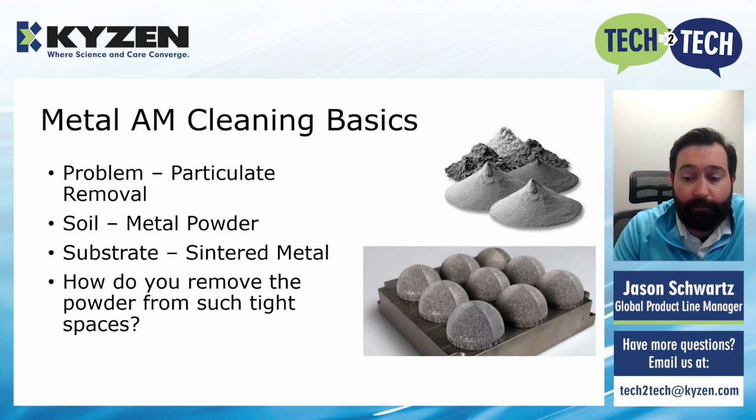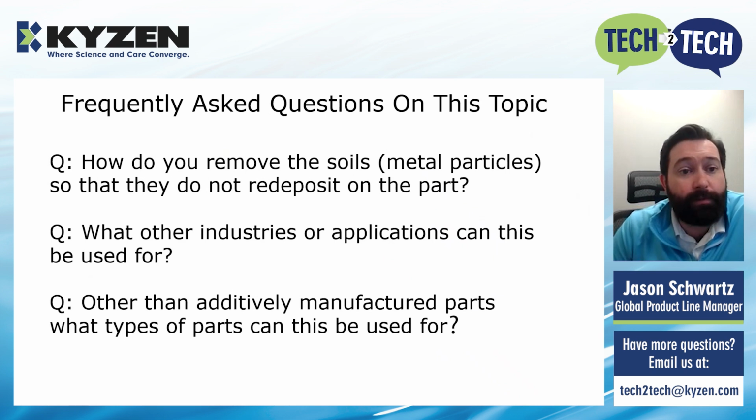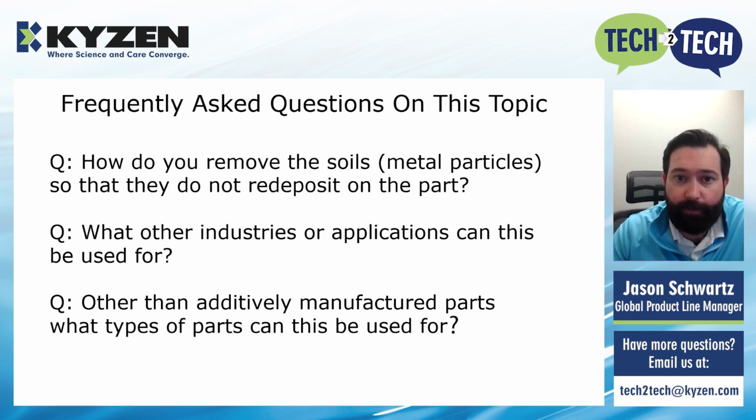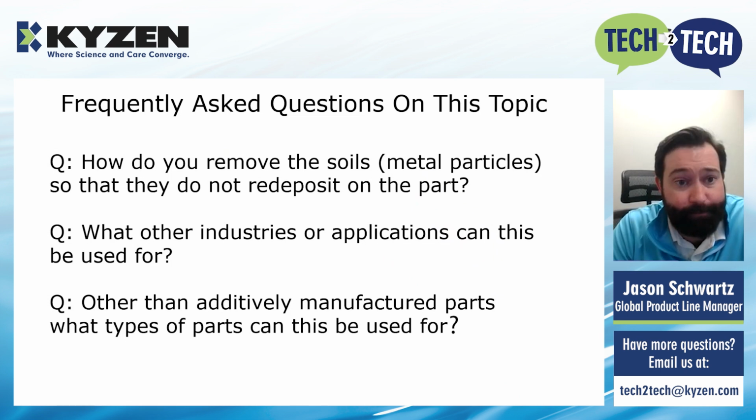I hope you guys have enjoyed it. We've got a couple of frequently asked questions that I will go through. So often one of the things that comes up is how do you remove the soils so that they don't redeposit on the parts? And that's a great question. And that comes down to filtration. That's the same thing we've figured out many times over in the regular cleaning process: working with your equipment supplier to match your filtration, the filter size, to your particle size so that those particles can't get through. Going through the different types, bag filters, whether you need a cartridge filter, dialing in that process is really important not to get redeposition.